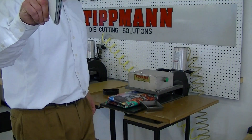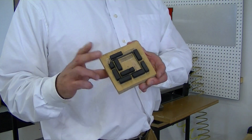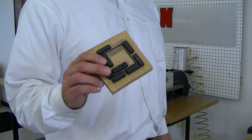To give you a little bit further explanation — because I don't think I talked about it — but this type of die, the steel rule die, is only designed for one layer at a time, as the forged die was designed for doing up to a three quarter inch stack.